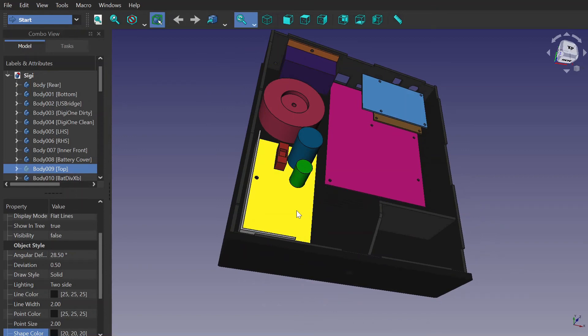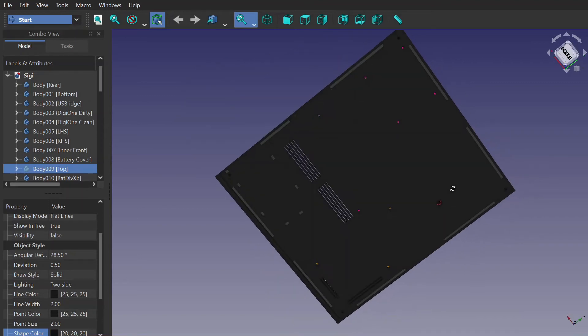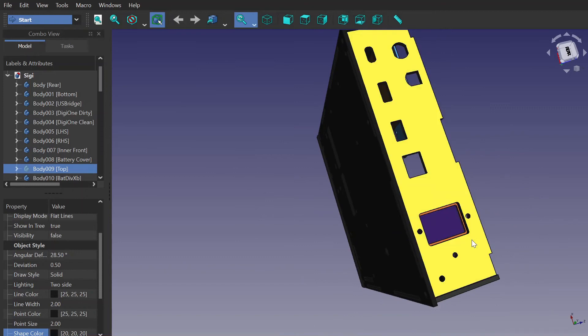The power supply is on the left. This is sized for my prototype board, but if I were to produce this as a DIY module, I'd design a neater single printed circuit board to fit in here, and that would probably be smaller. There are any number of low noise linear power supplies for audio on the market, so I'm not sure it's worth the effort. An IEC inlet with an integral EMC filter is fitted to the back panel. This cutout is specific for the Schurter GR4 which I had in stock, and if I was refining this design for production I'd probably change this to be more generic.